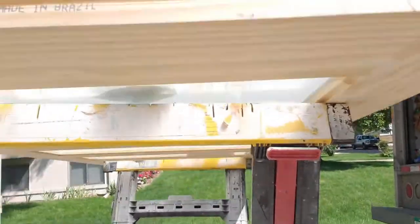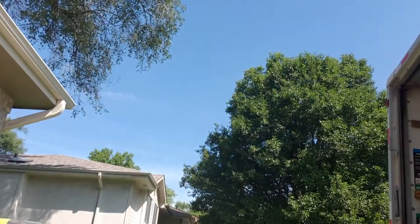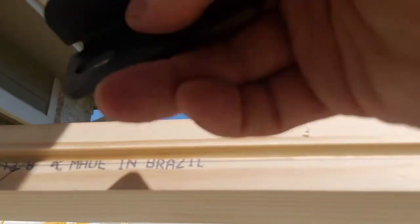This will fit in there and you won't even really notice your guide. If you're doing a project like this and don't have a router guide or a straight edge guide, that's a simple way of doing it — just some scrap wood and extra screws laying around, giving you a perfectly straight line pretty much dead center. It doesn't really matter if it's dead center as long as your guide is placed in the appropriate place on the floor so that the door is plumb and level. I hope you like this tip — give it a thumbs up and subscribe if you haven't done so. Have a good rest of your day!